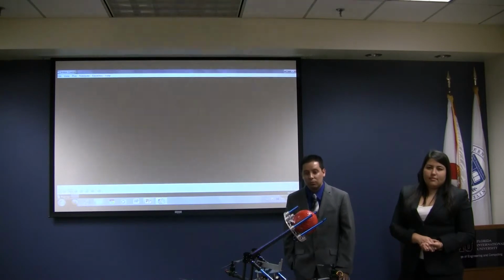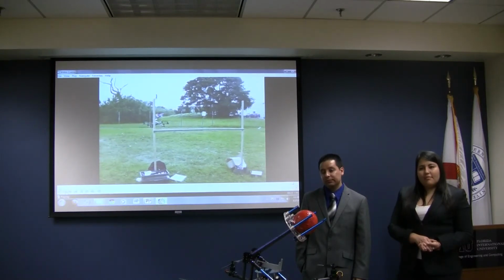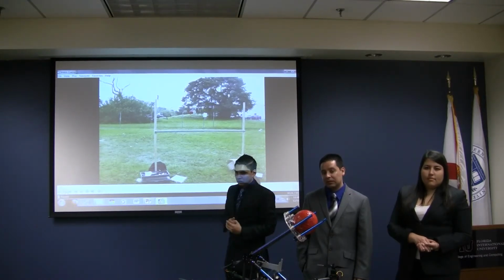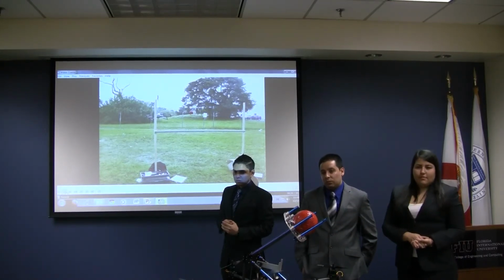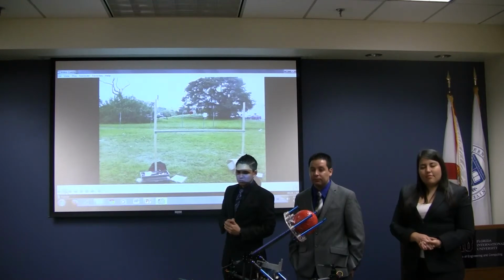Let's talk bottom line. You're going to put this thing at some point where it's going to fire the ball at the height of the window. So all you want to know is the distance from where your release is to where the window is. Now, if all this is doing is 2 feet, then you're back to the problem that Dr. Tomato is talking about: you're right in the middle of where this updraft of air is happening. I could understand if you were off, let's say, 10 feet and firing this thing into the window, away from where the smoke and the heat and everything else is coming out of the window. But if you're that close, you're going to be affected by the temperatures of the fire.